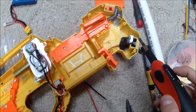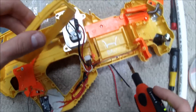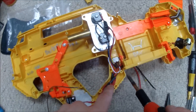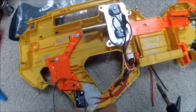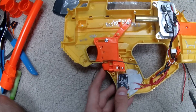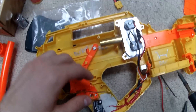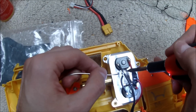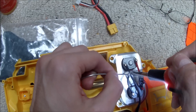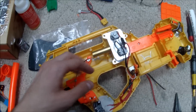The voltmeter is in the back and its leads are coming up around underneath the magazine hold point, then through the magazine guide. These are the main leads for the battery coming out down through here. The rest is a splice into the positive lead for the always-on switch, and there's a splice in the negative lead underneath. The last connection is making sure the negative lead on the motors — which will connect to the eventual lipo pack — has a really good capillary-action solder going through there. I'm really happy with that.